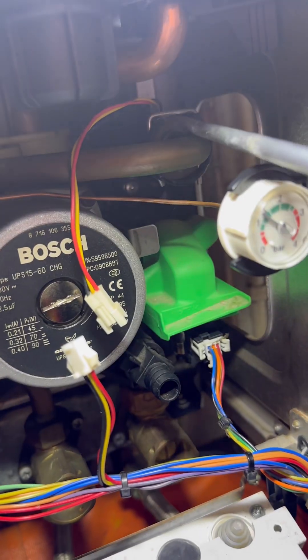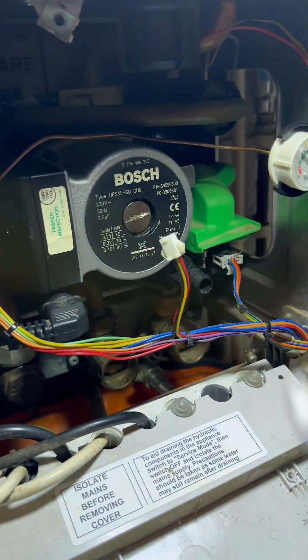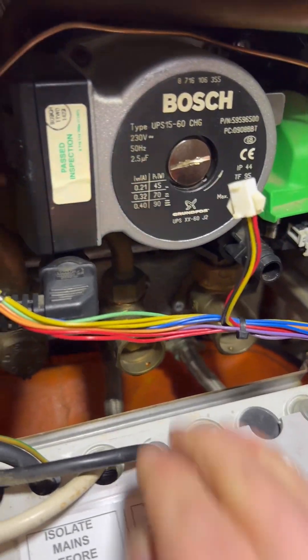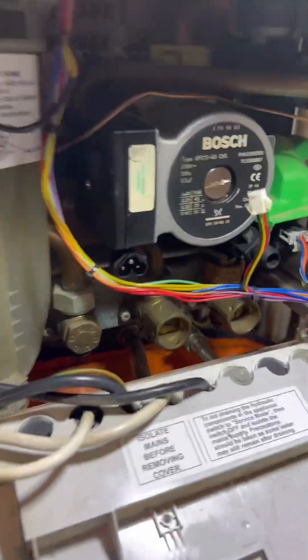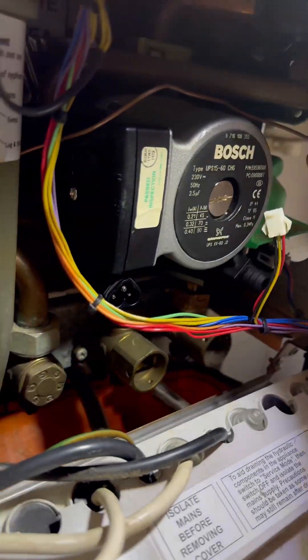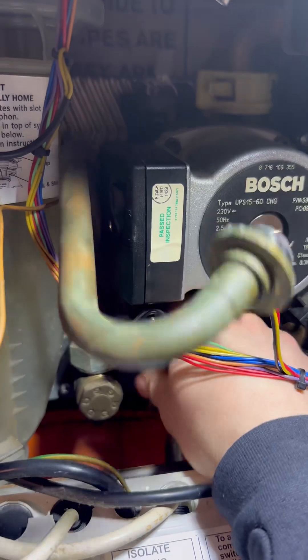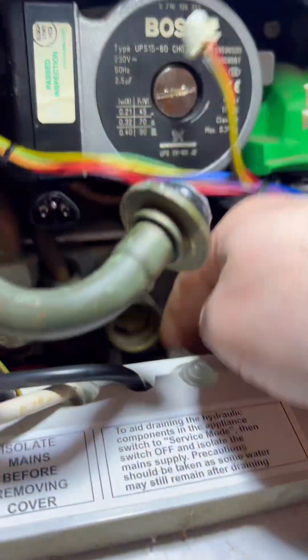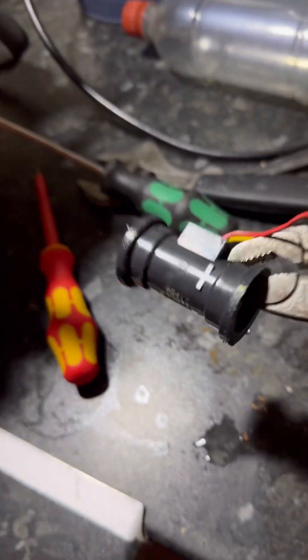Isolate the cold underneath, open a hot tap to relieve the pressure, flathead screwdriver to pop the pin out. It's a 24mm spanner on the nut for the cold - undo that. Pull the pump connector off as well just to give a bit more room, though you don't have to. Disconnect the flow turbine connector, get that pin completely out of the way, put it on the little shelf at the top. Undo the nut a bit more so you've got plenty of freedom, because you want to replace that fiber washer anyway. Get your grips on it and just pull it out - there's the turbine.